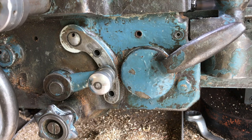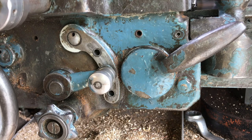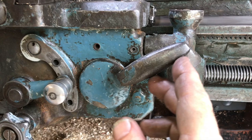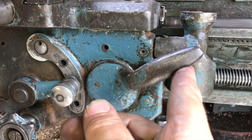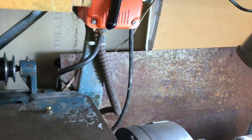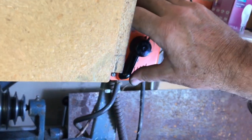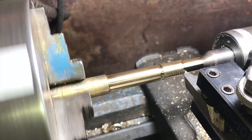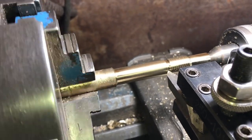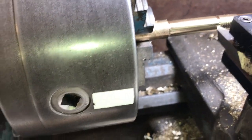We make sure the selector lever is in the central neutral position — the bottom position is for the cross slide automatic feed and the top one is for longitudinal feed. Then we pull this lever up, which clamps two half-nuts onto the lead screw visible in the background. That drives the whole carriage along. With the work ready, we turn it on and find the tool moves in the correct direction at just the right speed to make 1.5mm pitch threads.